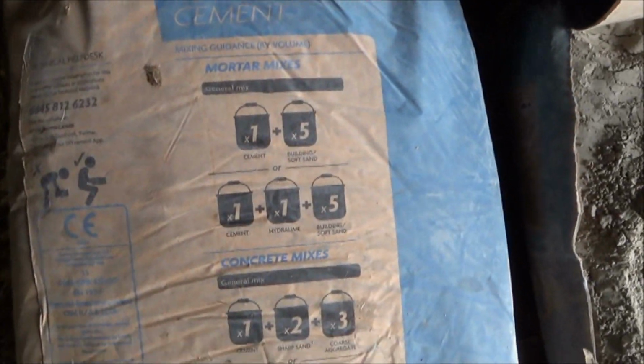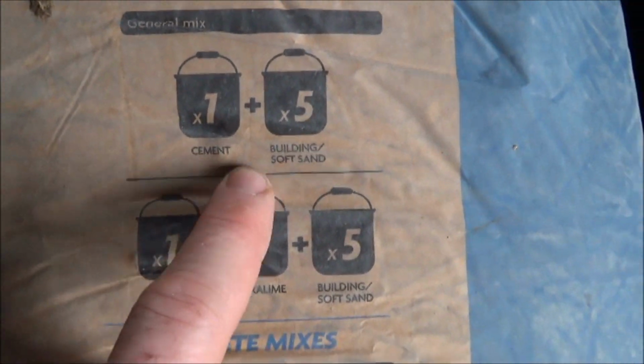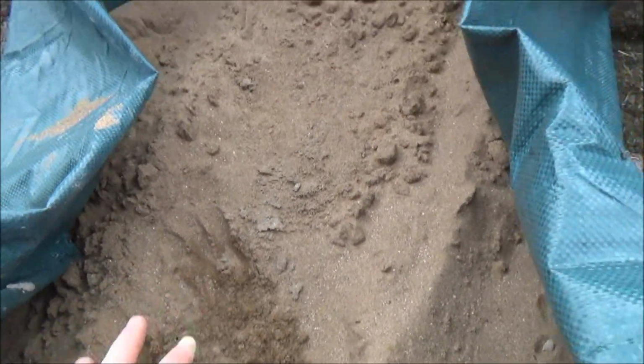Okay, I've got my bag of cement here, and if you look on the back of it, it's got the instructions: one lot of cement, five lots of soft sand. So I'm putting one lot of this in with five of these. And it's not an exact science, but I'm going to get it roughly right,